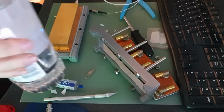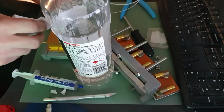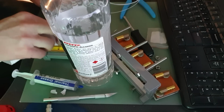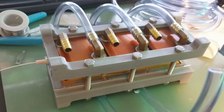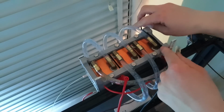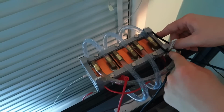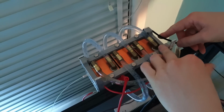On top of that, I would source copper heatsinks instead of aluminium. I would cool both the underside and top of the laser unit as well. Now, even though this isn't the best way of doing things, I still wanted to give it a chance because if I had to buy a cooling system, it was probably going to be another 800 to 1000 USD. To make matters worse, these systems can't tolerate any condensate on them, so it would have to operate within some sort of sealed environment. And really, those are complications I'd like to avoid.